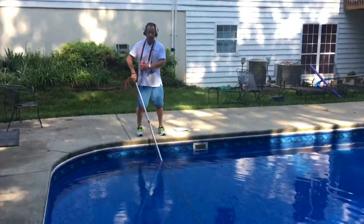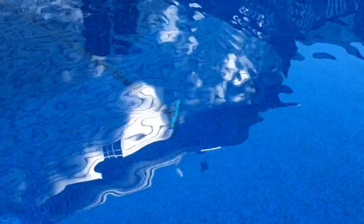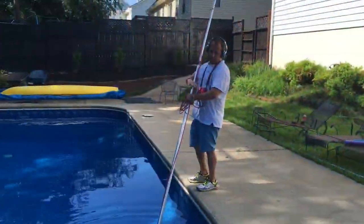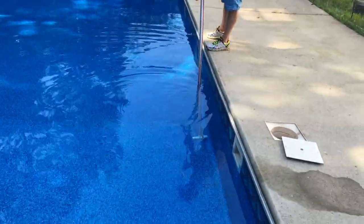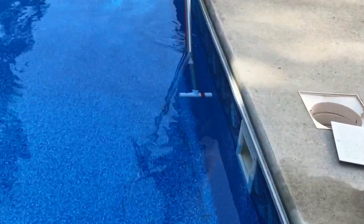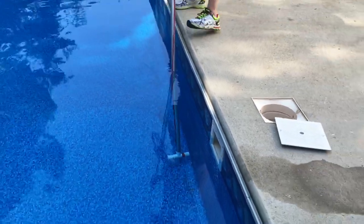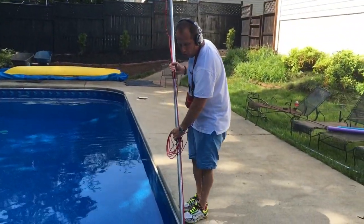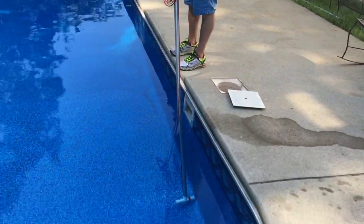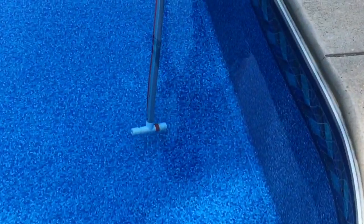The other unit we're using is for listening up high, for the coves, and for the walls — where we find most of our leaks. We're using the wall unit, which is almost cross-shaped. It allows you to listen to wall areas and radius areas, unlike the floor unit which lets you scan the floor faster. This lets you get into areas and listen along the whole entire wall and the coves. And actually, we're onto a major leak right here, which we're going to demonstrate.